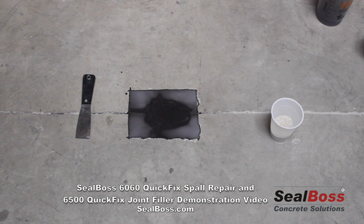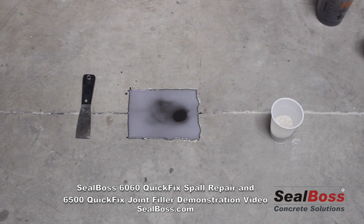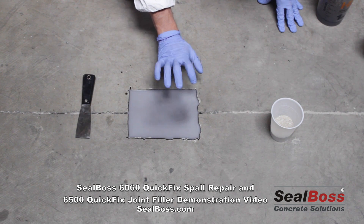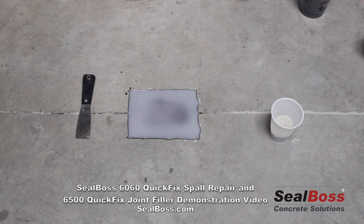We can see it coming in from all four corners — that flashing is a telltale sign of good reaction of the A and B sides. Literally before our eyes, the repair is solidifying and getting set in place. We call it Quick Fix for a reason — very rapid curing. For folks in colder areas, the colder the environment, the longer it'll take for the chemicals to react; the warmer it is, it'll kick quicker. Here in Southern California today it's probably in the mid-seventies, so the reaction time is to our advantage. We're pretty much at a full concrete gray now and will shortly reinstate the joint.